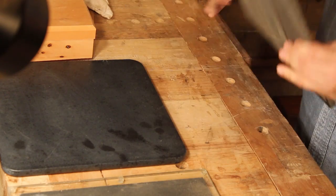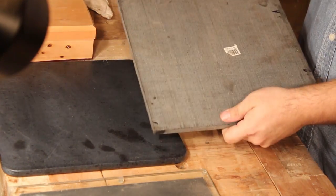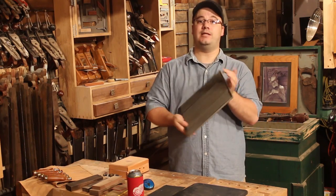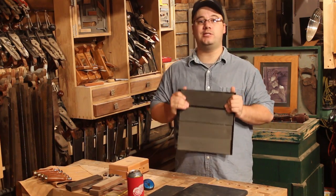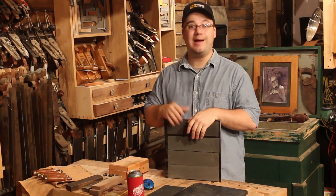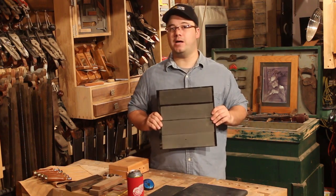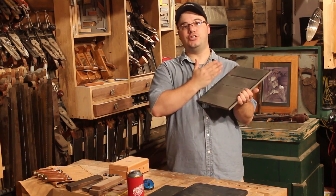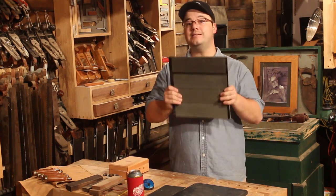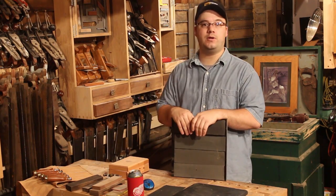Even less expensive is a granite or marble floor tile. Sometimes surface plates that you can get in 3-4 inches thick at woodworking suppliers, and cost like $1 billion, are made out of granite. But you can get a granite floor tile for like $5. And if you grab a straight edge to check them before you buy, you can easily find one that's super flat. I've seen guys like Christopher Schwarz use one of these.